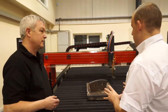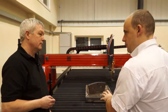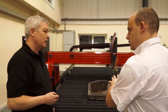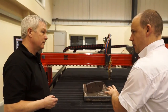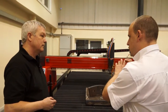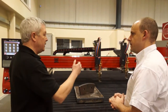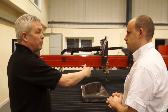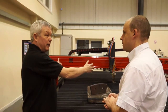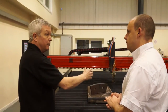If I just explore the extraction table that we've got here — this is modular and can be built to any size depending on the component or the size of the plate, but it's not actually attached to the cross rail or the sides? No. The idea behind it is that when you're loading a plate and a truck driver drops a huge plate on there, there's no shock loading going through any of the frame. Totally independent.